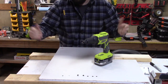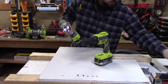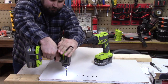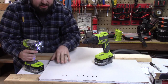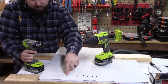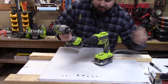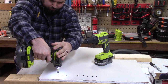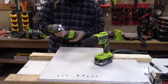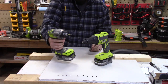Now let's see what happens if you try this with an impact driver. I'll put it on the second setting for the most control. Oh — see, right there, I accidentally over-drove it. That's actually past the paper and halfway into the drywall. Let me lower it to the first setting, the weakest setting. You can get close, but you have to be super super gentle with it. If you're going to drive a hundred or two hundred screws, you really don't want to use an impact for this.